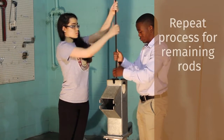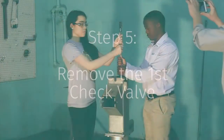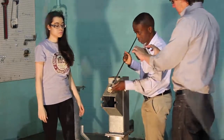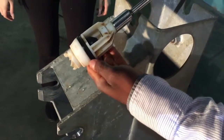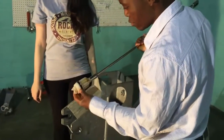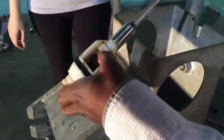You just repeat the same process over and over again until you come to the bottom sucker rod. This sucker rod is the last one. It looks the same on the top, but on the bottom is your first check valve. There are two check valves in this pump — an upper check valve and a lower check valve. They look very similar. Each of the check valves has a little rubber stopper in it. You want to make sure that it is there and hasn't been lost, inspect it for cracks or nicks, and make sure that it will freely move within the plastic portion. You can just take your finger and move it back and forth to see that it freely moves.